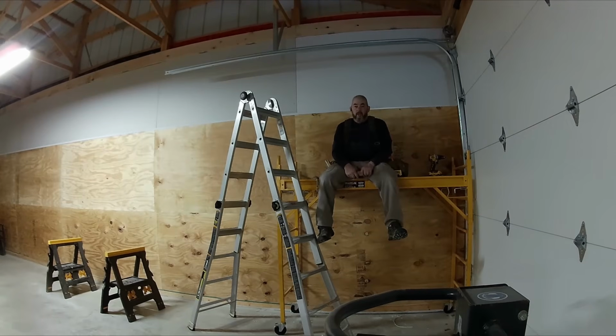As of today, I think we're going to go with OSB. We're going to do R49 rolled batt insulation. I'm sorry, not rolled. Well, yeah, 48 inch wide batts faced is what we're going to be putting up. Debating on a vapor barrier on the ceiling, and then we're going to put I think 1/2 inch OSB. Right now on a per square foot basis, nothing's cheaper, so I think that's the way we're going to go.